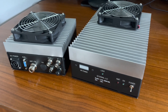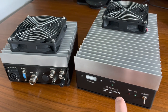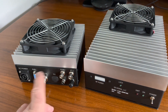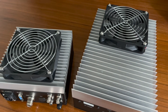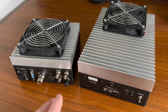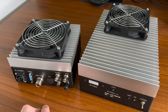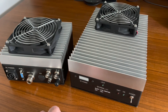The Q5 transverters come in various models and sizes. On the right we've got the 150 watt 2 meter version - that's a transverter with built-in amplifier and preamp, and there's also a 75 and a 25 watt version. On the left, just showing the rear, this is the 70cm 25 watt version - you can see it's a lot smaller with less cooling required. There's also a 50 watt and 100 watt version. As I've still got my Microset amplifier, this drives the Microset, so the rig feeds the 70cm transverter and the transverter feeds the amplifier.